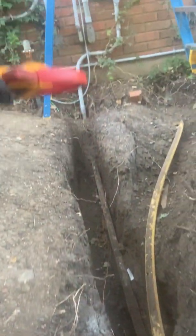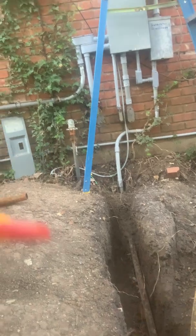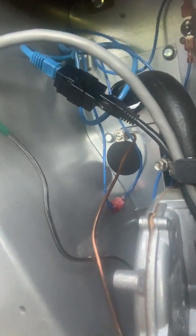For the gas hookup, the plumber tied into the T using yellow CSST pipe and replaced the rusting black pipe riser. The new lines run from the T into a solenoid. There's also a switch Kohler provides if you want to run propane instead — propane is more dense, puts out a little more power, but requires a different orifice and flipping that switch. In Central Texas we have a pretty reliable natural gas supply, so there's no reason not to use it. At maximum load it's about 193 cubic feet per hour.